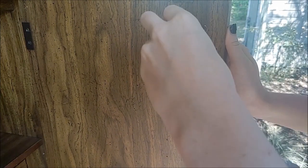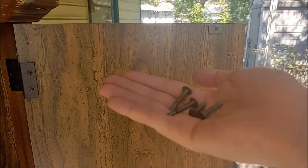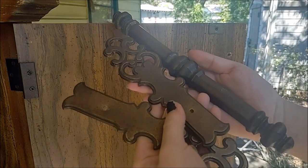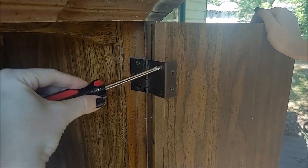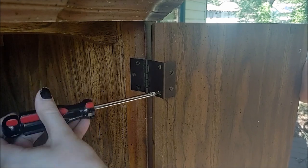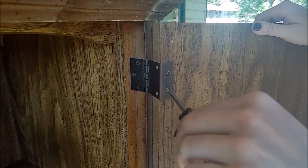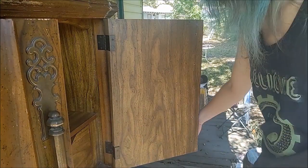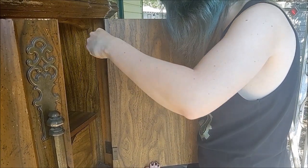The best place to start is by removing the hardware and setting it aside. Next is removing the cabinet doors. These things are surprisingly heavy, so I had to make sure to unscrew the hinges carefully in a certain order to keep the weight of the door from warping or breaking the hinges. I left one of the top hinge screws for last and firmly held onto the door while I unscrewed it so it wouldn't fall.